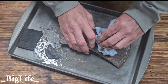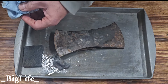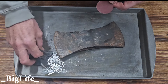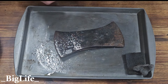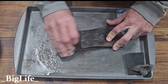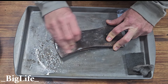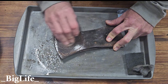On this side I am going to step up in aggressiveness. I'm going to use 240 grit sandpaper. I'm just lightly going over this because this will knock down a lot of paint or patina that's on there. If you don't want to do that, just continue down the route with the less aggressive means.